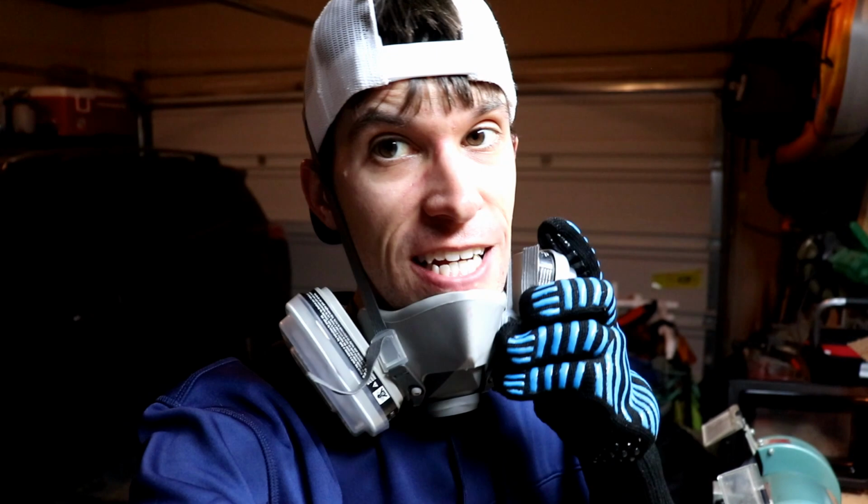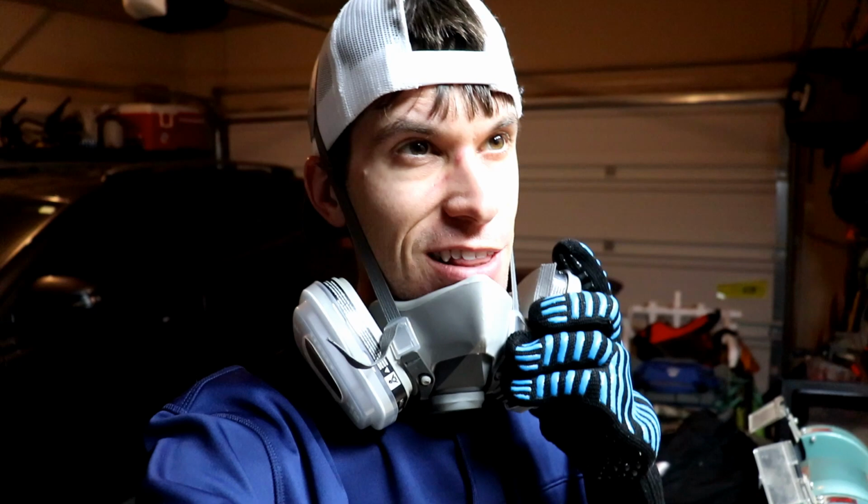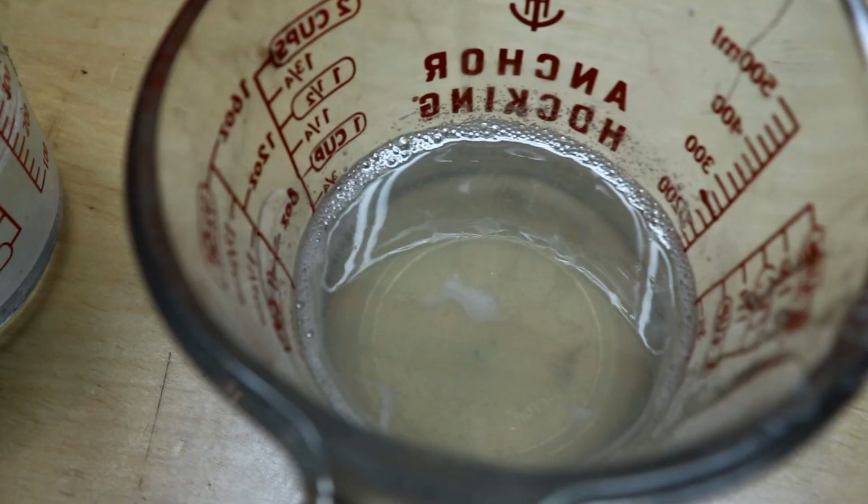Now, I gotta tell you, I'm really not too worried about the bubbles. Main reason, you gotta think about how air works. The hotter it gets, the more it expands. So that's about 350 degrees. Sure, it's going to expand, but as it cools, those bubbles will actually contract. So micro bubbles, the little bitty ones, are not really too much of an issue. You're not going to be able to see them in your bait that much. Sure, you want to get as many of them out as you can, but they've never really been that big of a problem. The bigger ones that you see around the edge, I work those on purpose to the edge so they won't be in my injection.